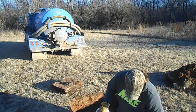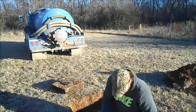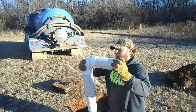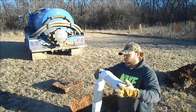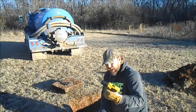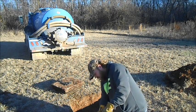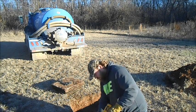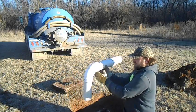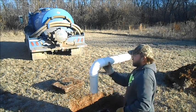We're going to go ahead and glue in the downturn so it sticks down into the tank a little bit. Purple primer — I'll prime this and this. Now, when you use an elbow as opposed to a tee for an outgoing baffle, it would be best to drill a small hole here so the thing doesn't get airlocked. We're going to drill that right in the top so as the water level rises it doesn't trap air in there and prevent air from getting out.